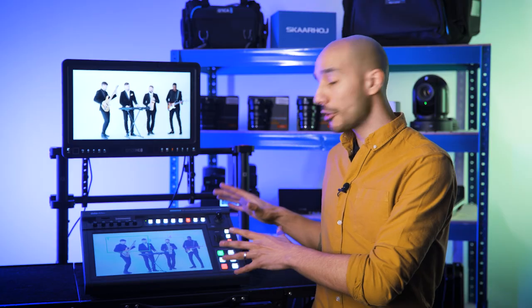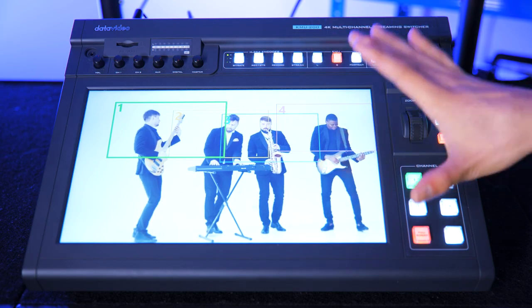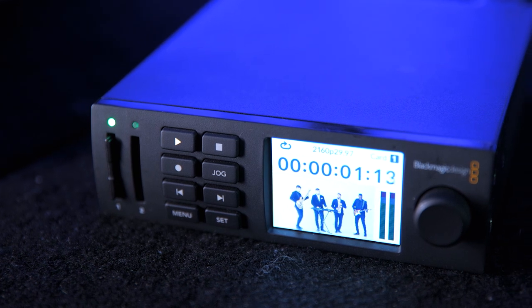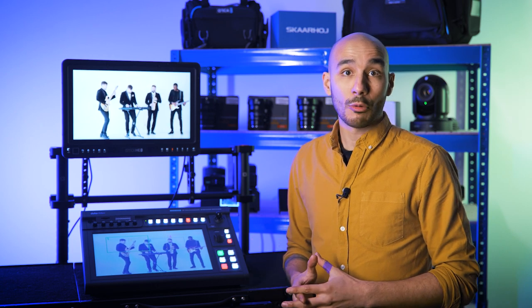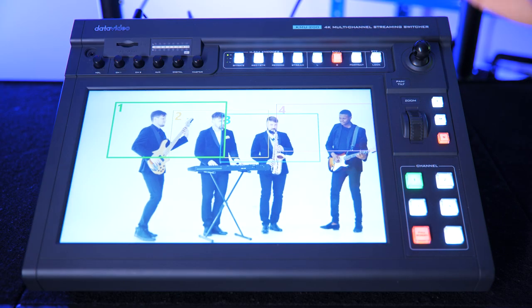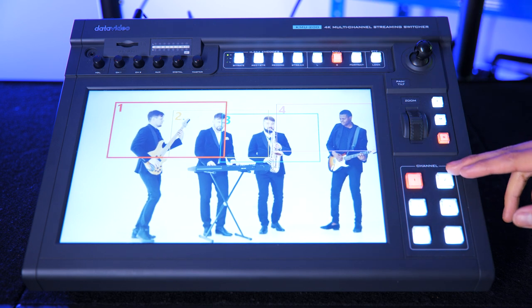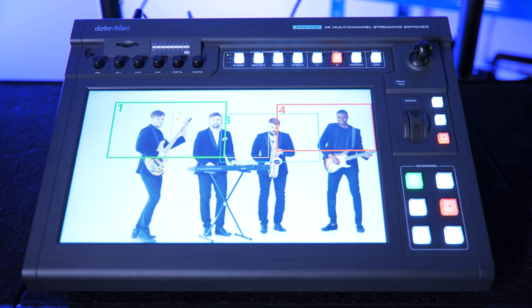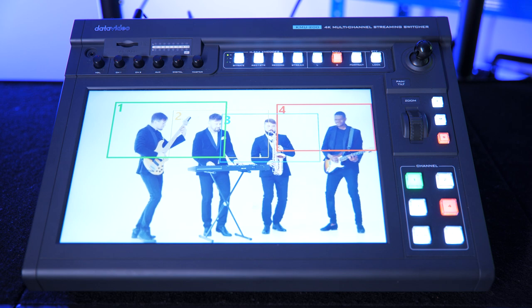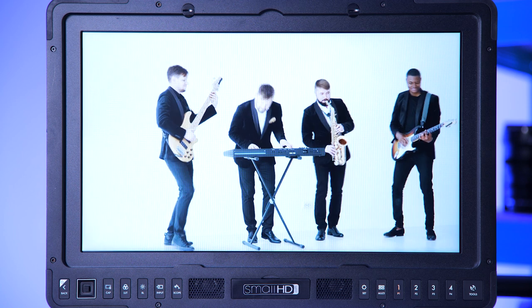It's all based around this large 14-inch touchscreen. I'm feeding a HDMI 4K signal into it — in this example we're using a media player, but in the real world this would be a PTZ or block camera, or mirrorless/DSLR style camera. We have four boxes on the screen showing four different shots we can create from this one 4K signal, and I can make these live using the physical switcher buttons on the bottom right-hand corner. When we switch, we can see which frame is live as it changes colour on the touchscreen, but to see the main program output you'll need to connect a monitor to the HDMI output, which is what this small HD monitor is for.